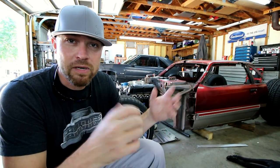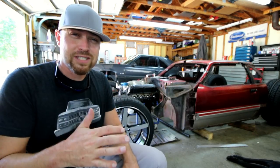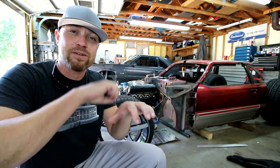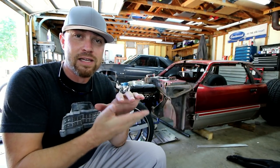It is very prone to cracking, and you don't want pieces of that chipping off or actually causing cracks within your tubing. So just like argon shields the weld on the outside of the tubing, you need argon on the inside of the tubing to do the exact same thing.